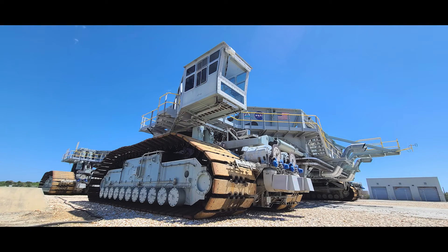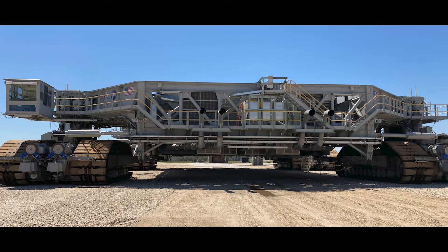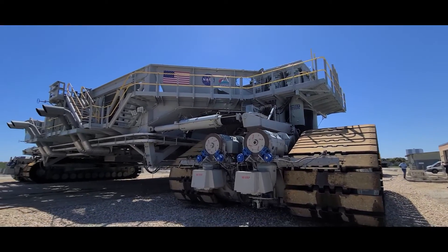It sounds like it was a combination of being due for upgrades on the machine, plus having the biggest rocket hauled in many generations — so those things needed to come together. We also did some proof loading, not only for the crawler but conditioning the crawler way, to make sure we weren't going to have any issues compressing the ground. Our heaviest proof load was 25.5 million pounds; the vehicle we've got now is about 21.6 million — much lighter than what we proof loaded to. The crawler responded and handled it very well. That haul-out is your Super Bowl.